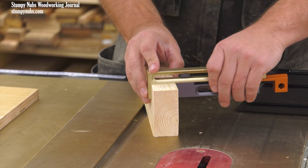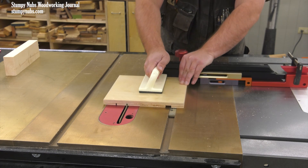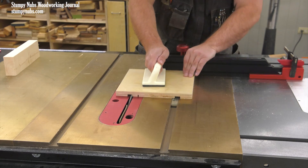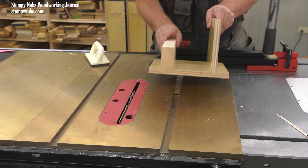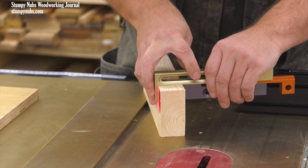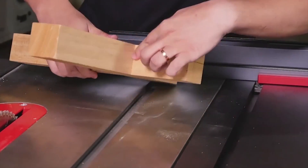Here's a wider workpiece. I just reset the gray end and I'm right back to the saw making the same two boundary cuts, then nibbling away the waste in between. There's no complicated setup, no learning curve. You could even use it with a dado set or with a router bit as long as they are narrower than the dados that you wish to cut. If you want to add some extra room in the joint — maybe it's too tight for glue — then add a slip of paper to your setup. And the same steps may be applied to various lap joints as well.